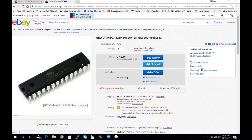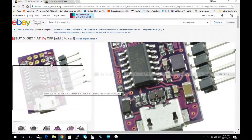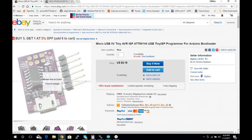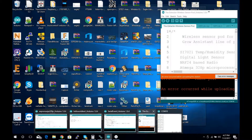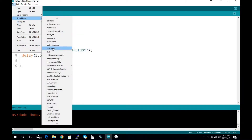If you've watched the previous video, you've seen how we hooked everything up. I'm using a micro USB ISP programmer — a dedicated standalone little programmer. If you don't have one, you can turn a UNO or Mega into a programmer. In the IDE, in the Examples folder, you go down to Arduino ISP, load that onto your UNO, hook the UNO to the breadboard chip, and it'll burn a bootloader.